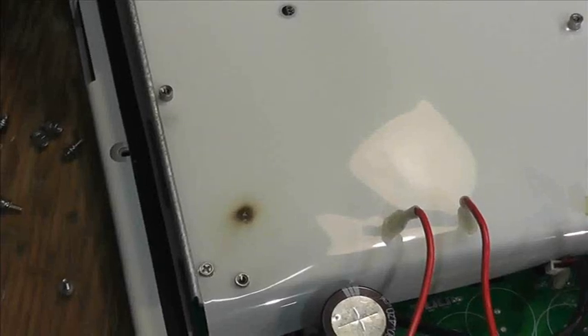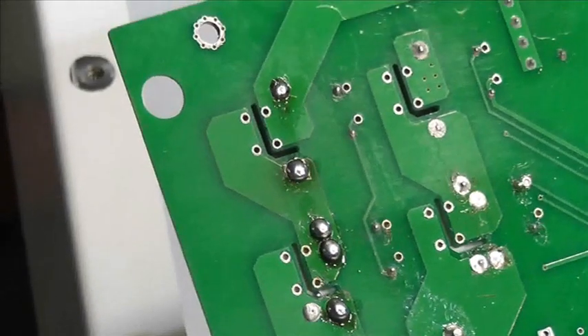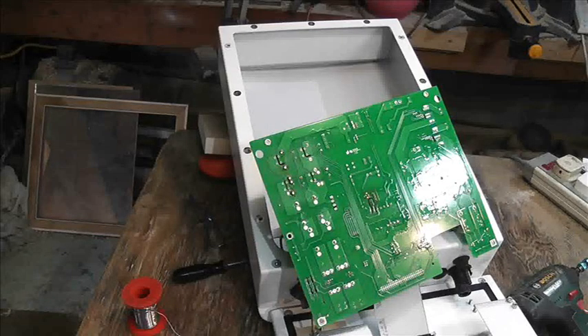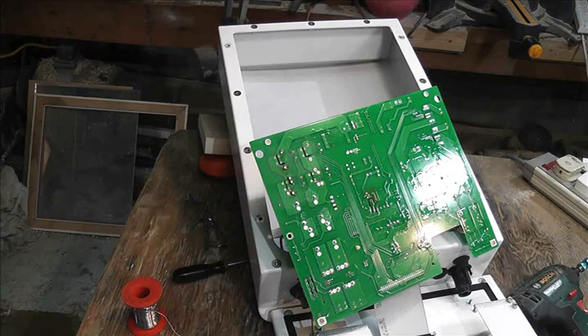There is a telltale sign down here as well on this insulating sheet - there's the burn hole. Right, so there it is soldered up, and I've soldered some more up because they didn't look that scintillating. I'll put the board back in place. Because that pin has got hot, I'm going to take the top of the relay off and inspect the contacts - is it the joint that's caused the heat, or is it the contacts causing arcing because it's been switched off in the middle of the day too frequently, or because it's been mounted somewhere very hot?